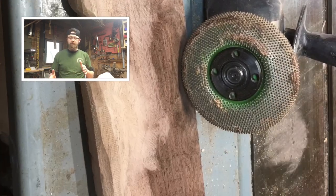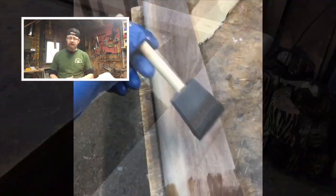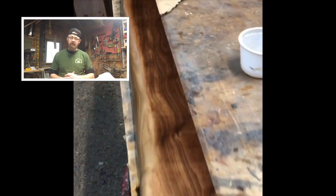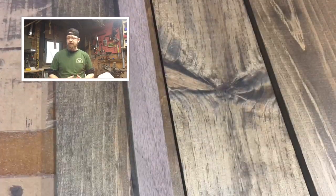Now you can see I've got my grinder going — I'm working on the door frame. These are shots of me shaping it, and here it is screwed together as I shaped each piece so that when it's all put together it looks like a single board that wraps down around the door. Here we are applying Danish oil to that walnut and you can see how it really makes it pop — I love the way this stuff looks. There's quite a bit of curl and nice figure to this wood. Any imperfections in the wood I mixed up epoxy and either wiped it on, brushed it on, or filled it in, then sanded it back prior to oiling.